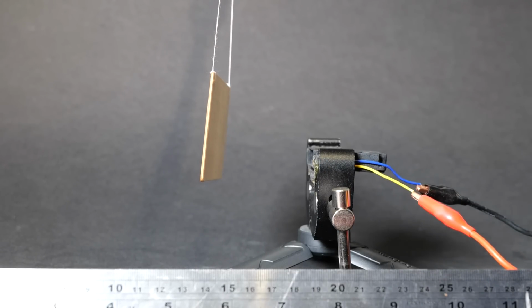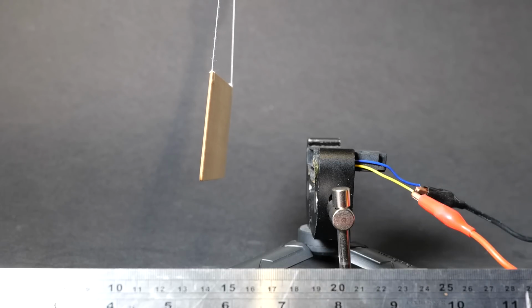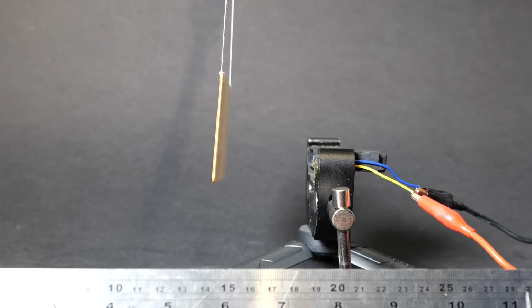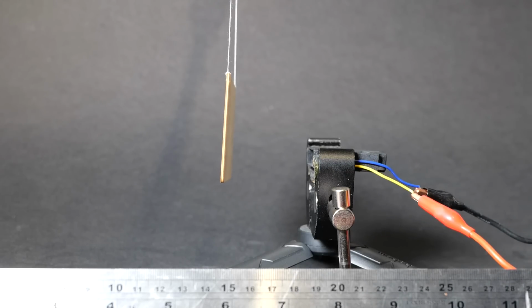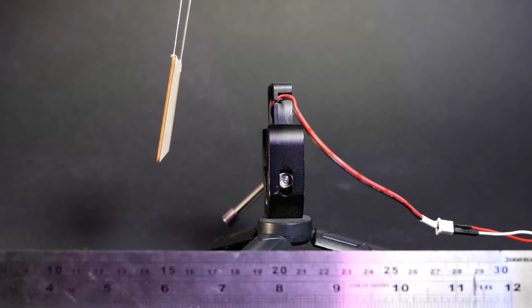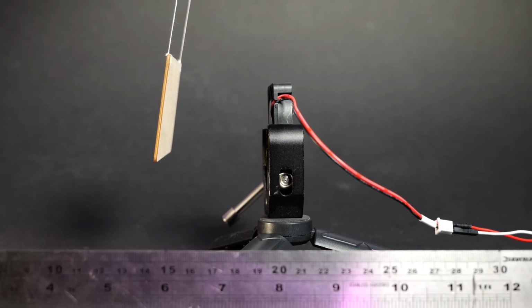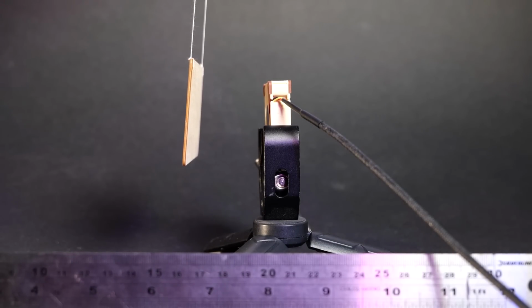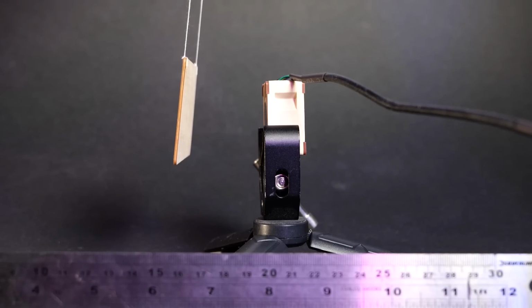Now the stock radial fan was quite good at pushing the air, even if I scale down the voltage back to 12 volts. To confirm that I'm not being biased towards the Noctua fan, I also verified the flow this way with the 24 volt fan that is by default present on Ender 3 printers. And as you can see, the amount of flow I was getting from Noctua fans was actually quite decent for both configurations, the 10mm one and the 20mm one.